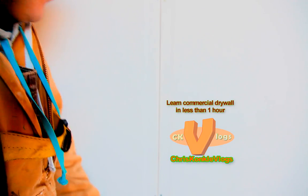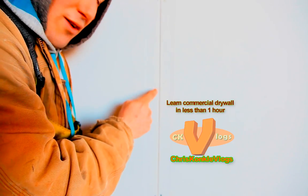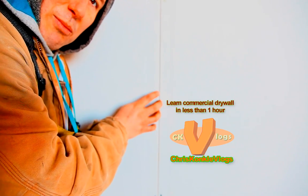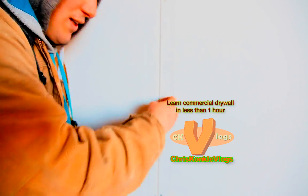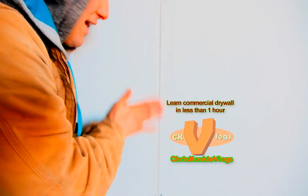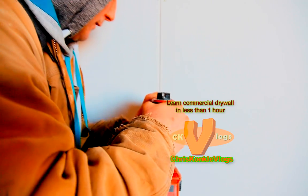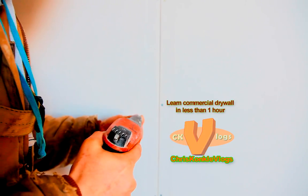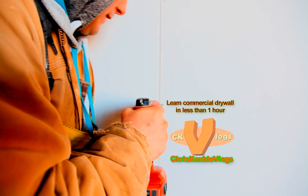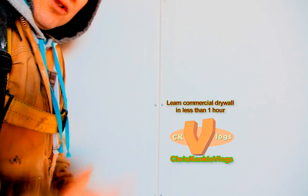So always screw in your soft side first, and then your hard side. Remember to lock the stud into place properly. If you screw in the hard side first, your bevels are going to be pushing out, and that'll be an uneven surface. Just like that. So, a couple things.